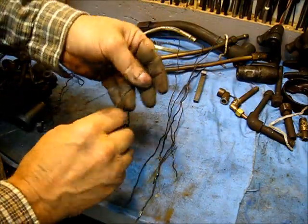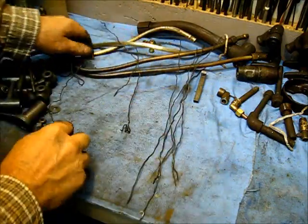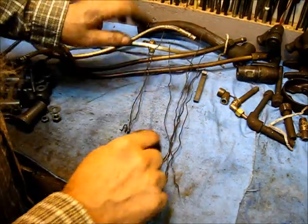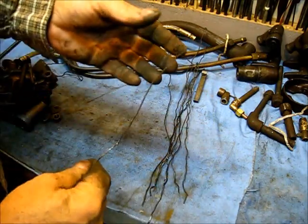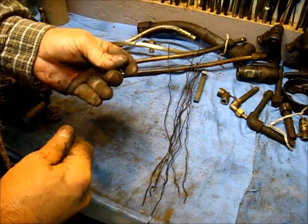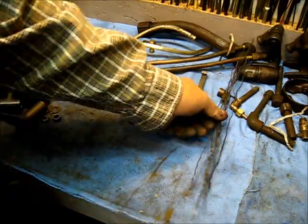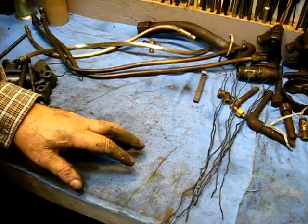Afterthoughts — I said I wasn't going to say anything else about this electrolysis, but what I'm doing here is just giving these wires the courtesy straightening. If you use a different kind of wire, this is soft iron wire — it has no coating on it, they call it mechanics wire. If you use an electric fence wire that's got that plating on it, you will end up with a different kind of off-gassing. Galvanized zinc plating is not good. But what I'll do is wire up a whole new batch and charge that tank back right now, get it going.